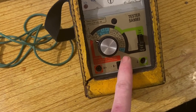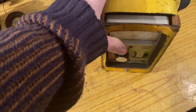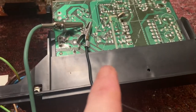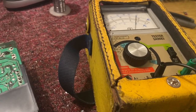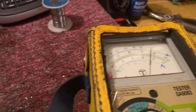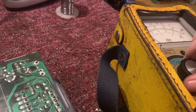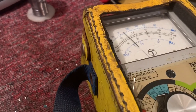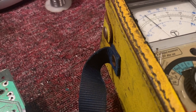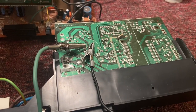The same could be done with the mega-ohms range. I'll get some tools and parts and get going on making these plugs. I've sorted out some leads - made a crocodile clip lead and a standard positive meter probe lead. Checking the resistance of some of these smoothing caps in the power supply - it's fluctuating, because it's charging up that cap.